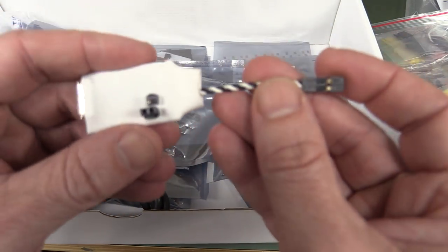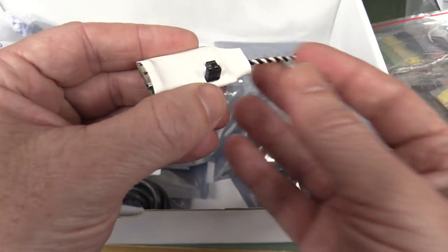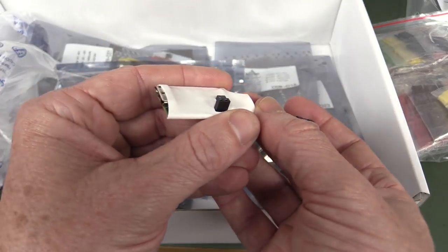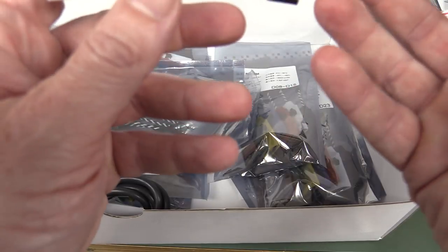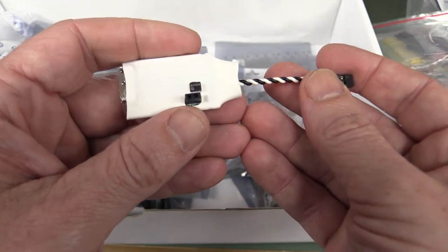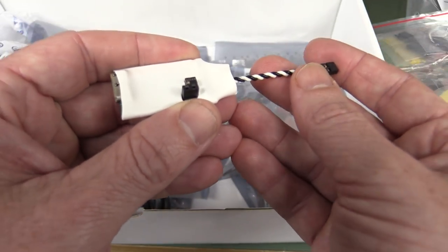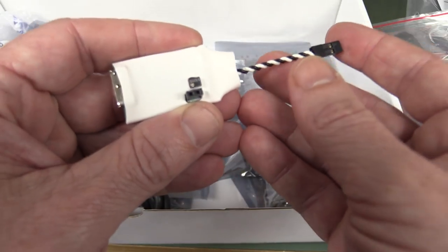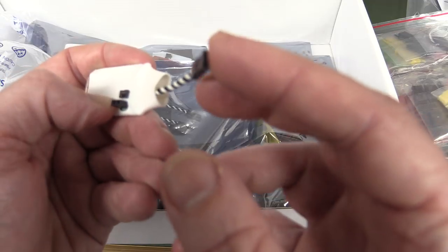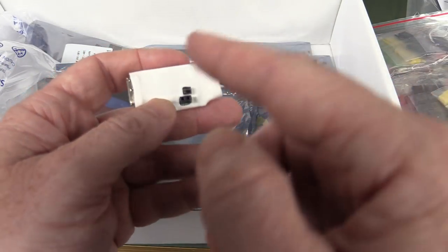Now, the thing with this is that when you're designing a real complex digital system, you know you're going to have to debug it with a logic analyzer, protocol decoder, and debug all the memory system and everything else. You won't jump to the final product version of your PCB, or you might, but you'll also design a version of your PCB that has a whole bunch of these 0.1 inch breakout headers, usually right around the chip that you want to debug.